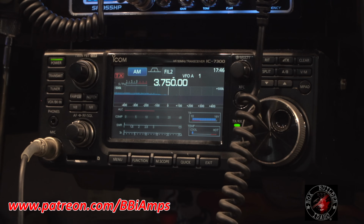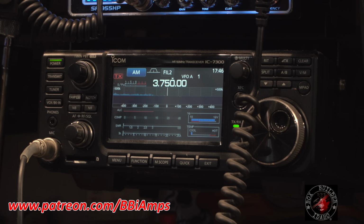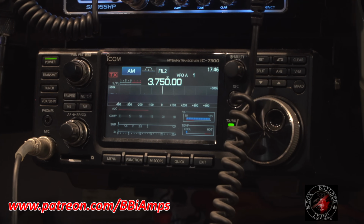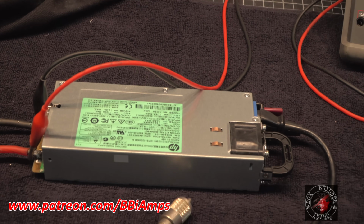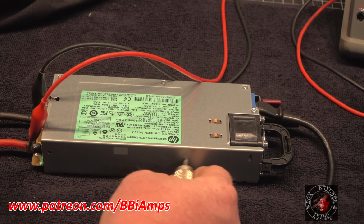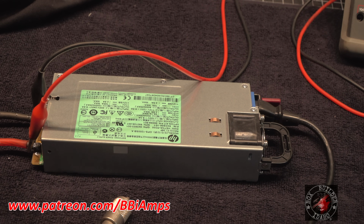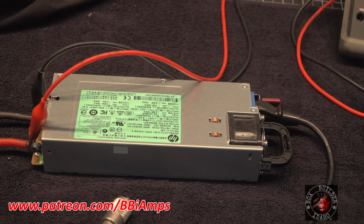Case. Now, let's shut the power supply off. Noise is still present. Okay. It's so minuscule though. That's just the environment that we're working in. And to get that noise, I'm doing this. If I was to do the same test with this here, we'd have 50, 60 plus dBs of switcher noise. So a little bit cleaner design.